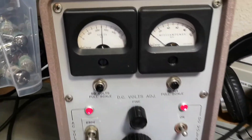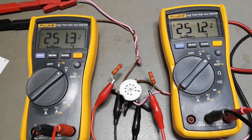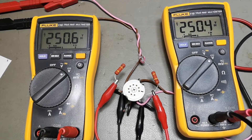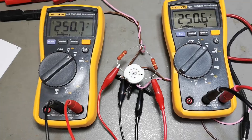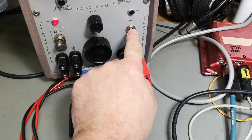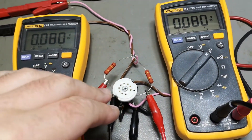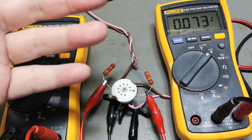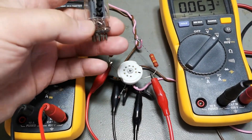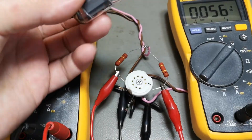I'm actually using a really old HP supply. I set the voltage to 250 volts as you can see here — I just turned it on so I need to fine-adjust the voltage a little while it warms up. I really recommend you have a power supply where you can turn off the high voltage, so you can swap tubes while testing without getting electric shocks, because 250 volts could maybe tickle your fingers a little bit.